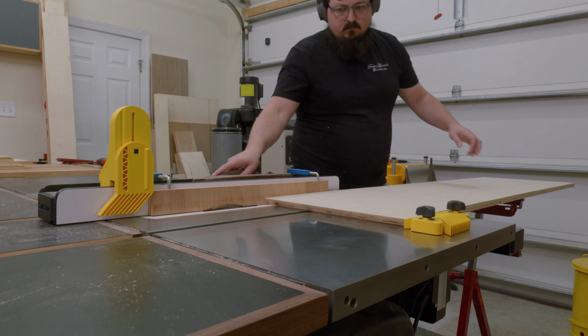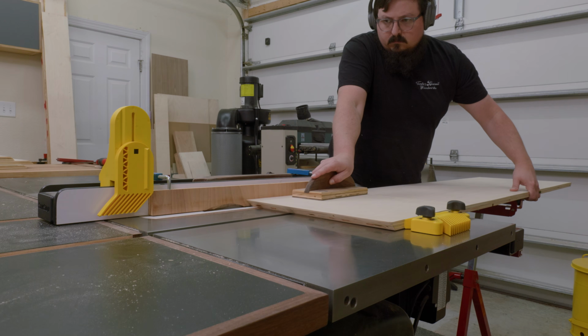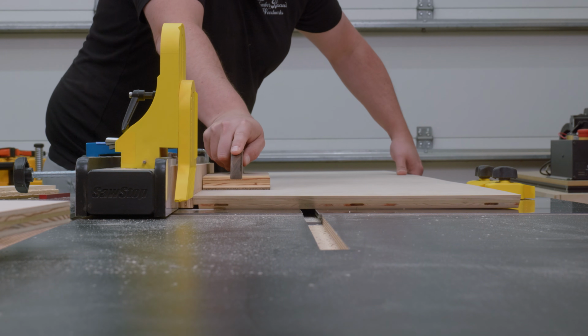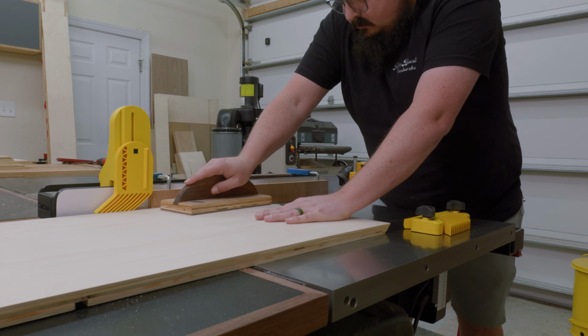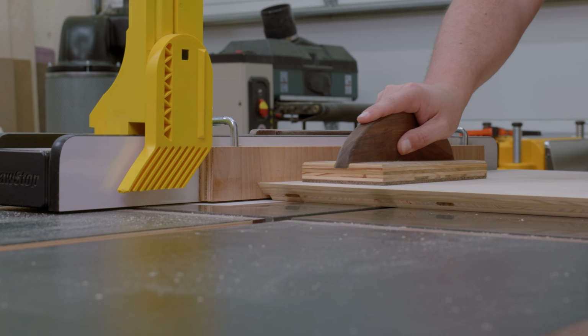Now this is just a 1/4-inch deep rabbet, so I'll set the cut up again using a sacrificial fence. What this is going to do is allow for my rear panel to inset into the back of the carcass, and in doing so, it'll assist with preventing some racking. Now since my top and bottom pieces are so long, I just use a roller stand to help give me a little support off the back edge of the saw. Then from there, I could go ahead and do the same thing to my 2 side panels.